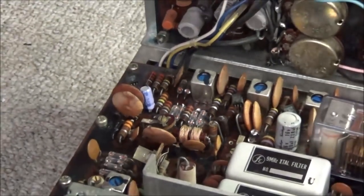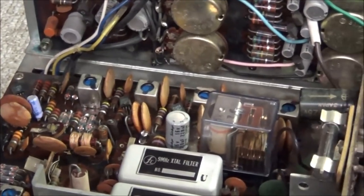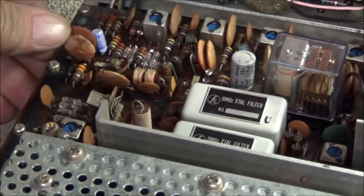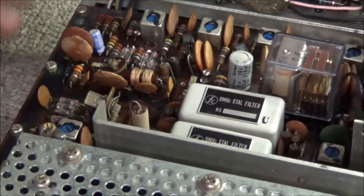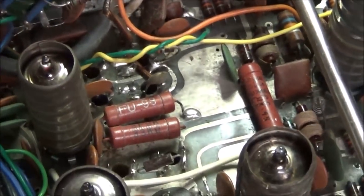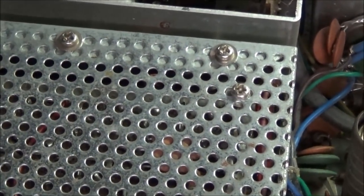I did go back and clean this circuit board, and you see just how nice and shiny this board is when it's cleaned properly. But yeah, I don't know. We'll have to test a few of these and see if they're okay. I don't know if they've been moisture impregnated or what it is, or somebody's cleaning fluid. I do not see it over on the other side of the radio. Those look normal. But the ones over here on the RF/IF board really look bad.